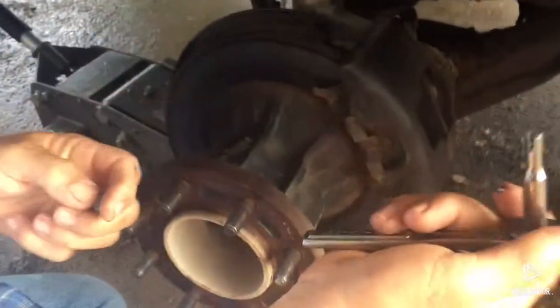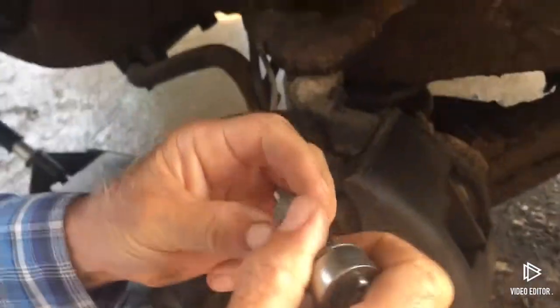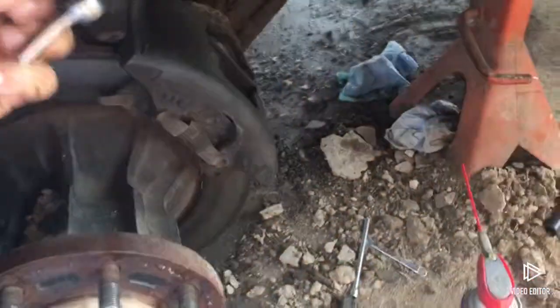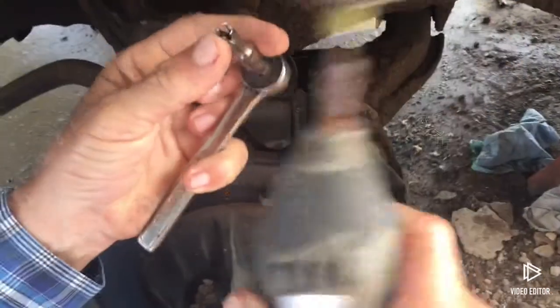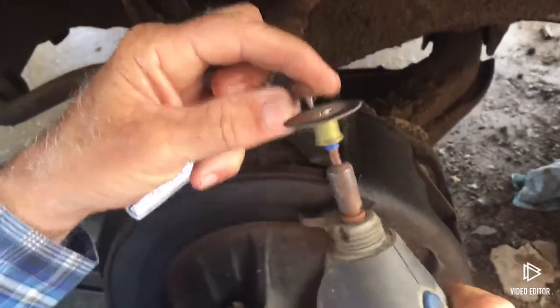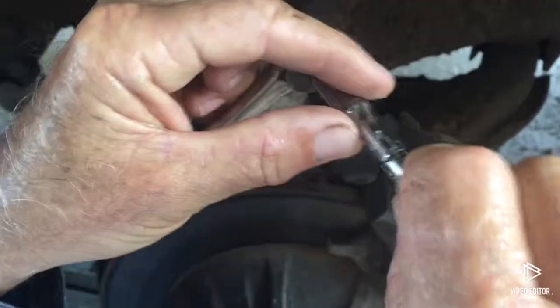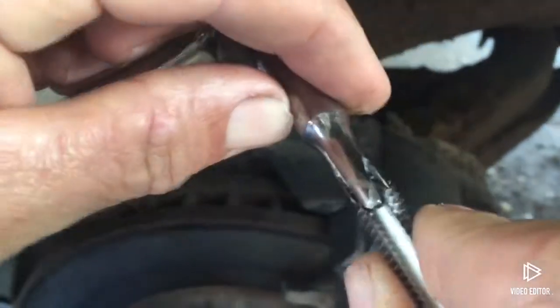We took a socket that would fit in a 3/16th hole — that's the hole we're working with — and then took a Dremel with just a regular old cutting blade and cut notches so it would fit in the flutes on the tap, like so.